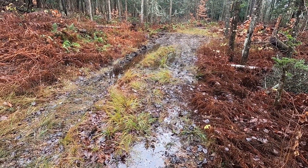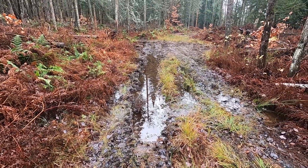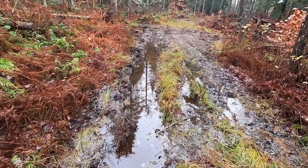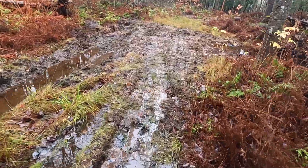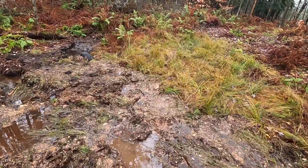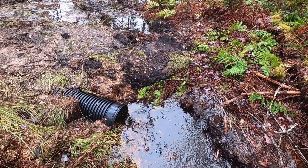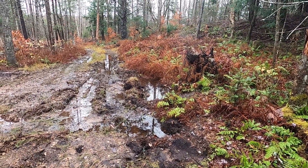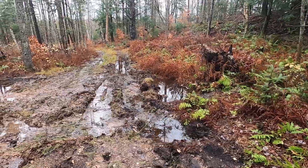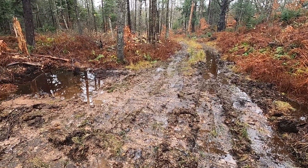When I first put this road in — I think it was two years ago — I wondered if I was going to have a problem, or if I was able to build it up enough with the soil I gathered from around it. But it is a problem and will continue into next year. I'm not going to do anything this year — it'll probably freeze over and I can use it in the wintertime. I did put a culvert in, but same issue with the ledge — I can only go down so deep before I hit impenetrable rock. So there's water flowing into it, and I'm going to have to use fabric here, build it up maybe a foot or so, and I think that'll fix the problem next year.